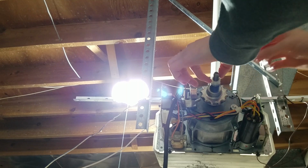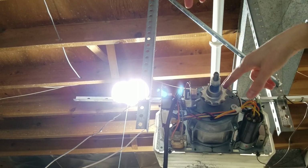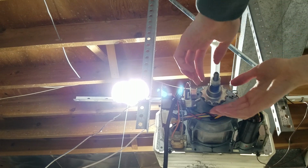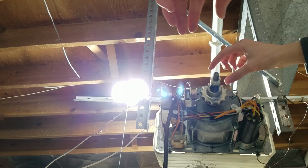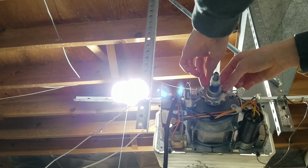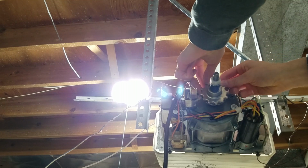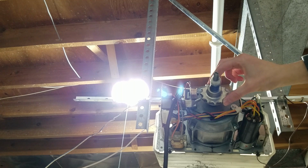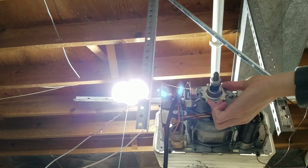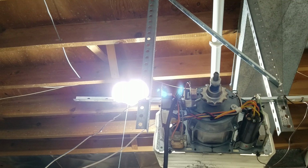This is basically the force setting. The screw runs all the way through the motor on this operator and sticks out the back. And behind this gear, there's a plate that's actually part of the motor itself that engages with this. When you tighten this spring, it gets pushed up farther. And if there's enough force for those to slip, this Reluctor here will detect it and keep the door from moving.